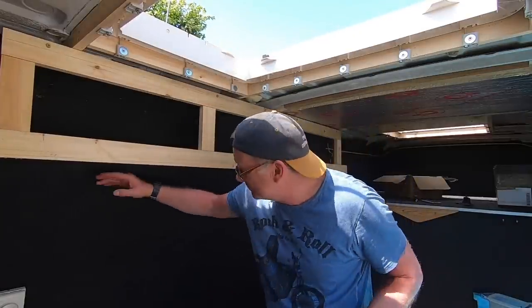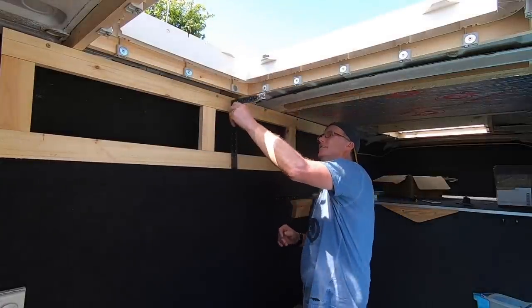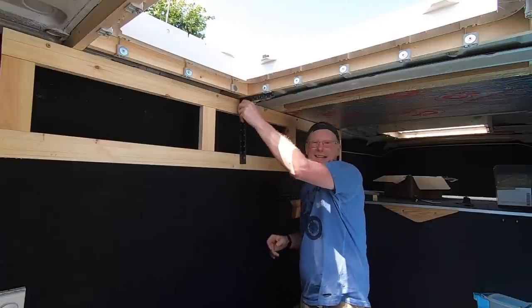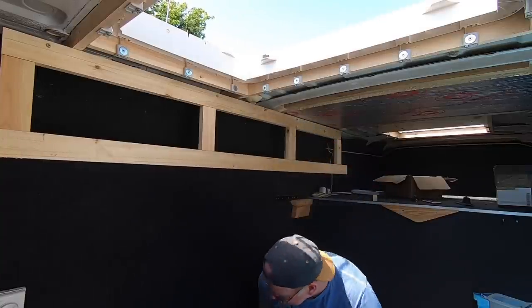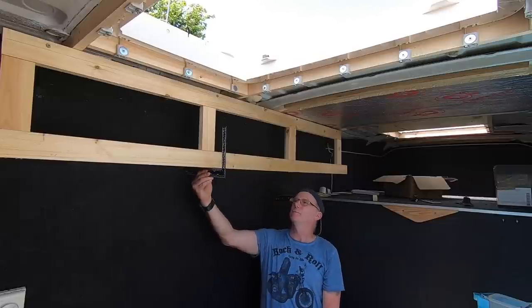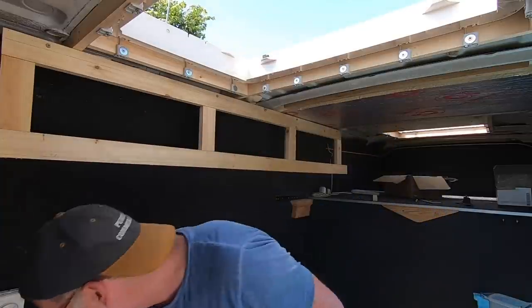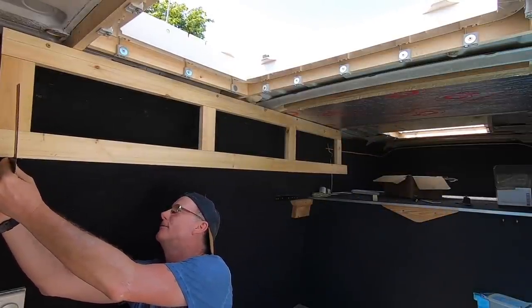Now I need to work out the height of my back runner. To do that I'll use my set square - put it up here like this against the ceiling, get this nice and square. There it is, that's not bad! And now using the set square again I can work out where this back runner's got to go, starting at this end and getting it nice and square on that wood.